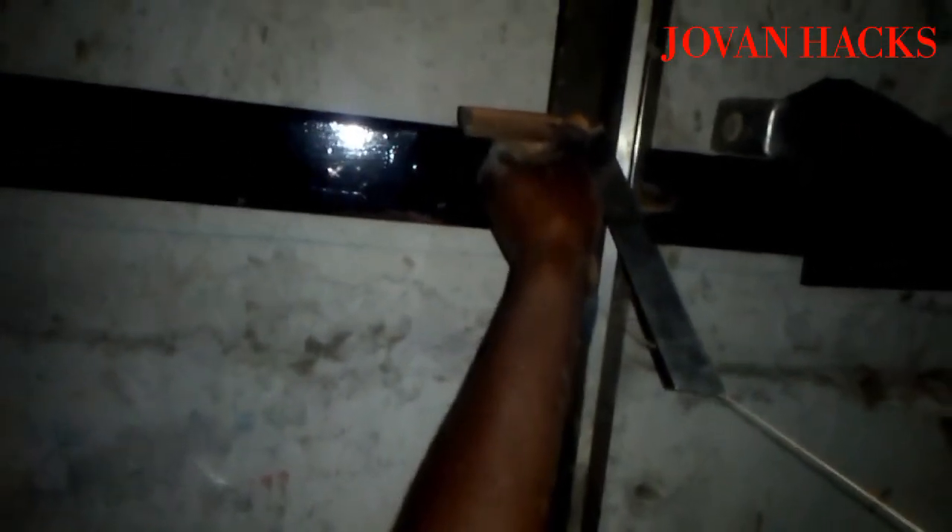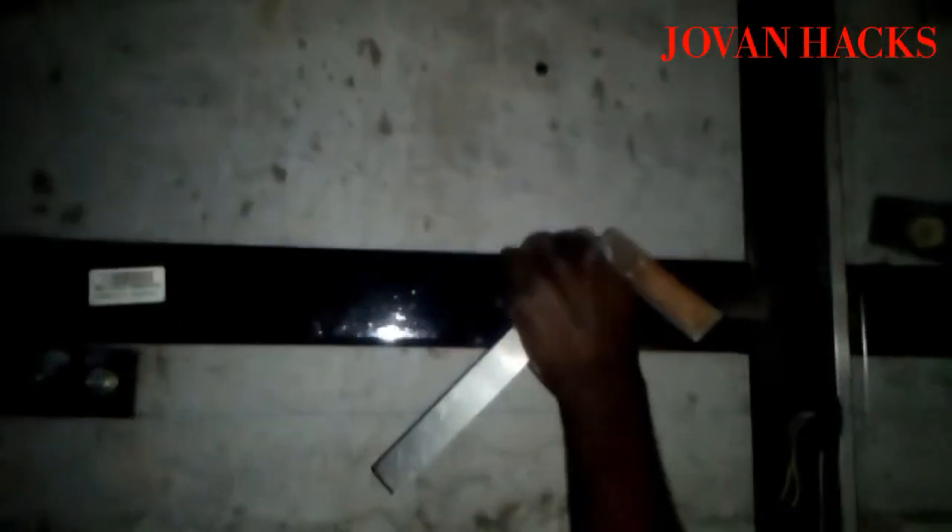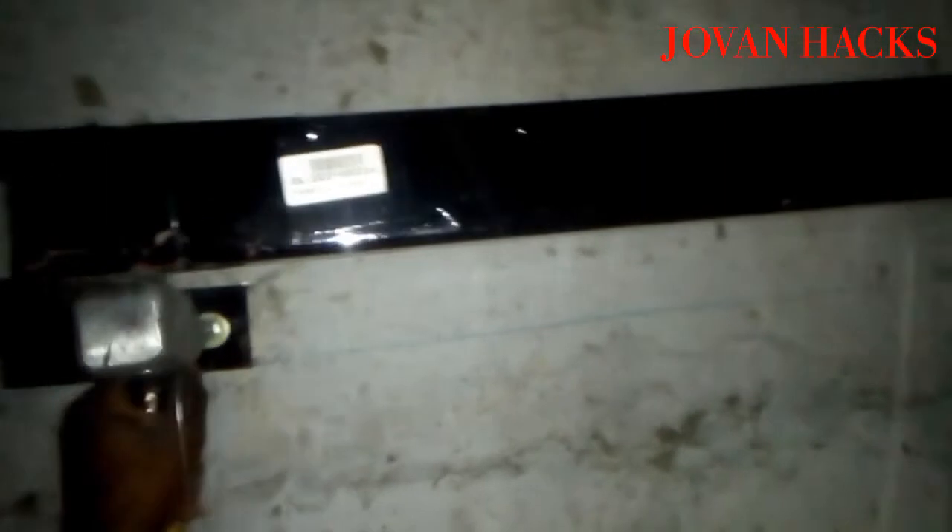It has to be perfect. This is a slow process and most of the actions are repetitive because this is the first setting — we are at the topmost bracket, the topmost support. We are going to set the topmost support first, then go back to the pit and set the bottommost support. The other middle guides we shall just use the measurements and adjustments we got from the master brackets. You have to move it with the hammer slowly until you get perfect squareness and remove the twist, as the guides might be facing different directions.